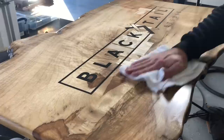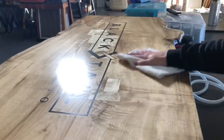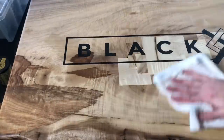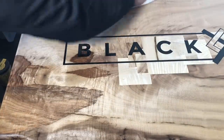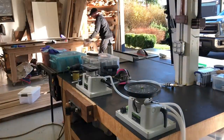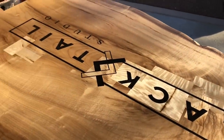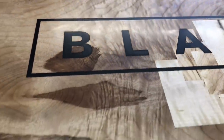The result is a really pretty finish — similar to an oil, not quite like a linseed oil, but it's a hard wax finish. Very durable, very pretty — wipe on, wipe off. If you do decide to use Odie's oil, just remember to get every last bit of it off. Since this is sanded so high, it came off pretty easy. If you're sanded to a more suitable grit in the 320 to 400 range, you often have to put your elbow into it to really scrub it off. I also wanted to get it into the sunlight here and show off a little bit of the color and sheen from the Odie's oil and the high sanding. Something I didn't anticipate: the growth rings were harder, so they polished up shinier than the rest of the slab — which was an unexpected but kind of cool effect.